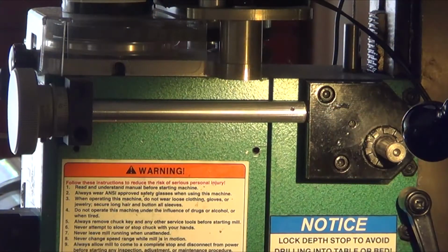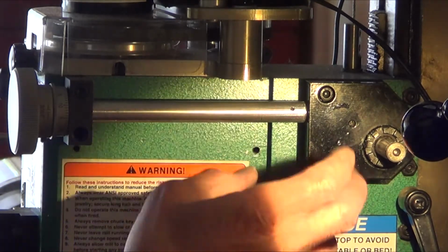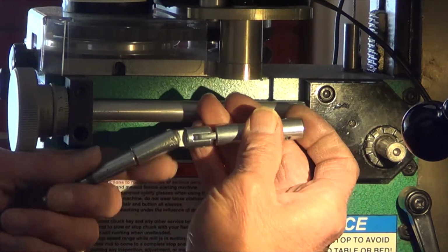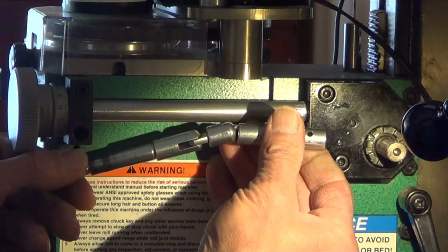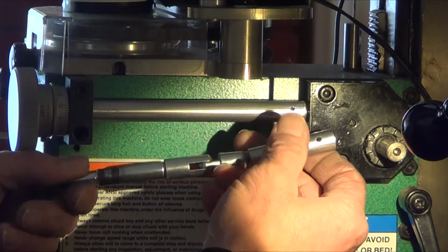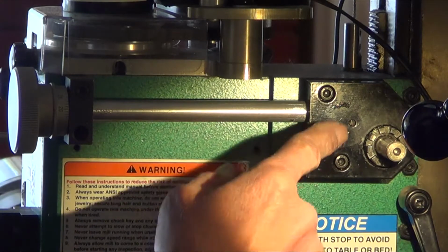Alright, just wanted to share this little piece. I did have the mill grab at one time, machining a part, climb milling it, and it grabbed. Somehow it translated up here, where with this guy, first in the beginning too, this was real sloppy in the opening. So I had taken this off, put it in the vise and just kind of closed them up a bit, so I didn't have that much backlash in this thing. But somehow, like I said, it bound and it translated up here, so this would turn, and then there was one particular spot where it would always just be rough and then turn easy and rough. So I figured, why don't I just replace this with one solid shaft and see if I can line it up. And it lines up easy.